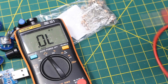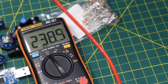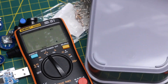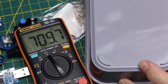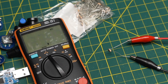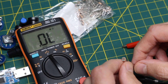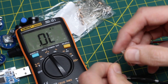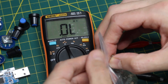I turned on a light source and put this as close as I can to a light bulb. I saw around 230 ohms when I could get this directly on the light. If I try to put it in darkness, even moving it away a bit, we got 700k. I don't know if it can go over a meg or so, but it goes from relatively low to significant resistance. These might be put to use where I want light intensity to change characteristics of maybe an op amp audio effect circuit — some sort of modulation, whether it's volume or pitch.